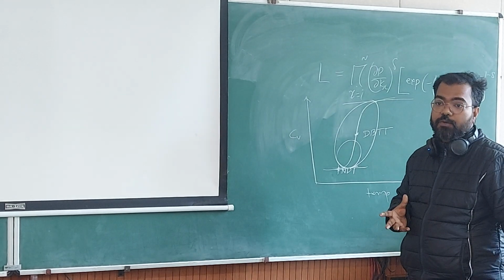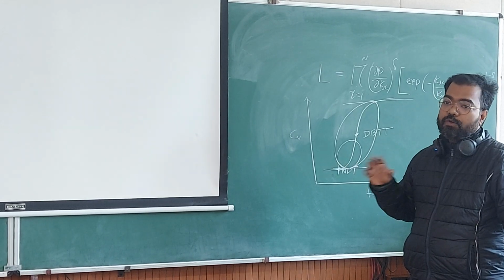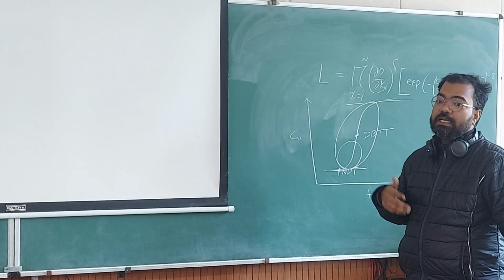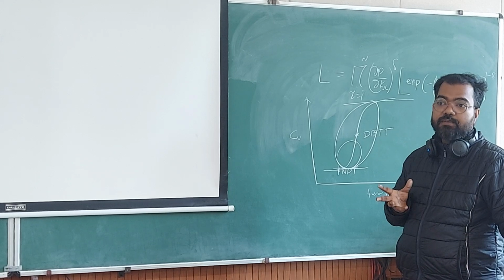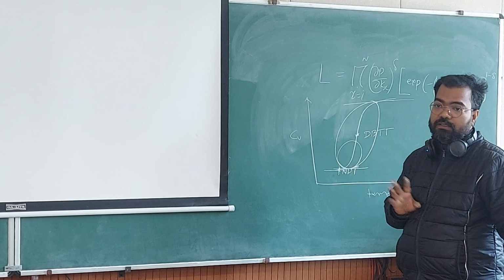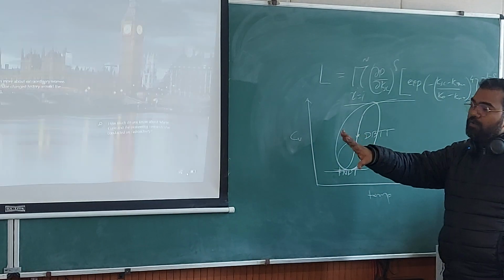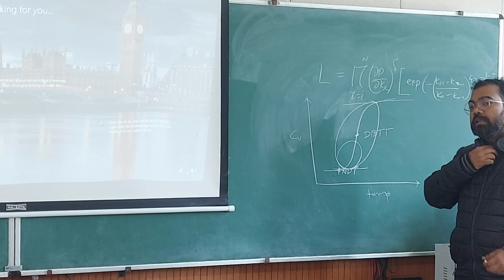Suppose you have developed a new material which is very close to reactor pressure vessel steel, and now you want to find out the value of T naught. Then you have to do some testing, and how will you decide what should be my test temperature? For that, you must have an estimate based on the yield strength and other things, so that I go in the lower region of the transition temperature where I don't expect a lot of ductile tearing.